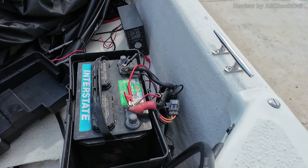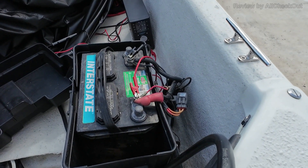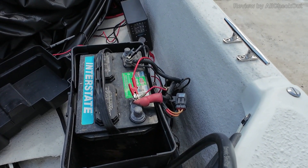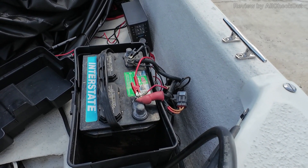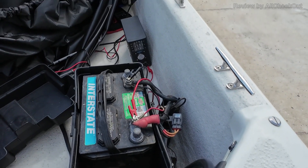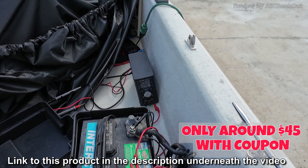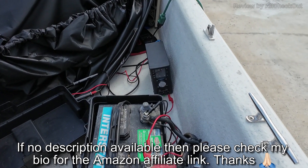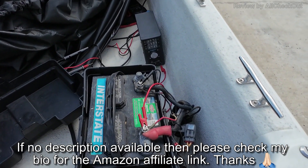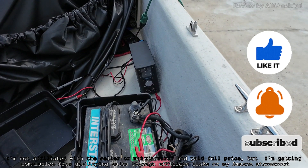13 volts is pretty much the golden spot for this battery. I don't have to watch it all the time — I can just leave it charging, and as soon as it's approaching 13 volts, which is maybe 80% of capacity, it will slow down pretty much to zero. Absolutely awesome. I've been using this charger for many, many things already and it's worked perfectly. Full recommendation from my side — you can buy it directly on Amazon. I hope I've been able to help you a little bit with this video, and thanks for watching.